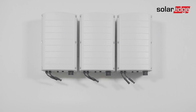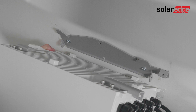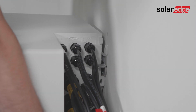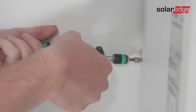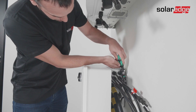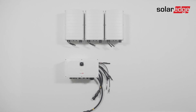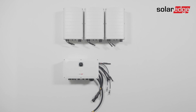Next, we'll mount the synergy manager. Lift the synergy manager from its sides, align the two side flanges of the synergy manager with the side mounting tabs of the bracket, then lower the synergy manager straight from top to bottom until it's evenly resting on the bracket. Insert and fasten the two supplied fixation screws to secure the synergy manager to the wall — one from the left side and one from behind — using a torque of four newton meters. Your inverter mounting is now complete. Please join us in the next video of this series, where we will guide you through the wiring process for the three-phase inverter with synergy technology up to 120 kilowatts.